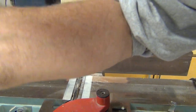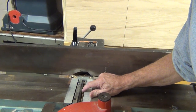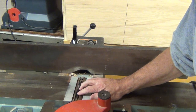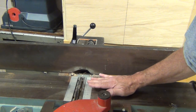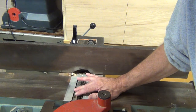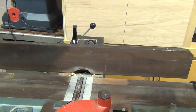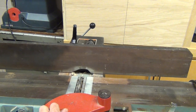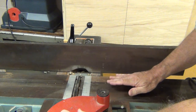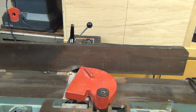There's a drum with long sharp blades — they call them planer blades or jointer blades — and they spin around really fast and shave away layers of wood. The infeed table where the wood goes into the cutter is a little tiny bit lower than the height of the cutters, and the height of the cutters should be even with the top of the outfeed table. You can adjust the table height to take a bigger or smaller slice. That's the jointer — the powered version of the hand plane.